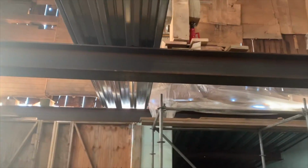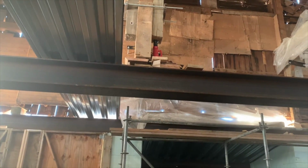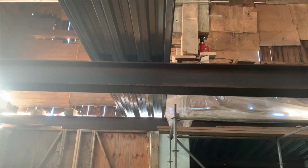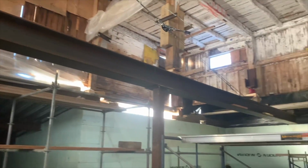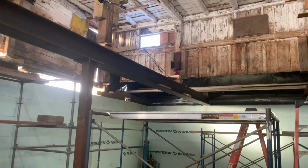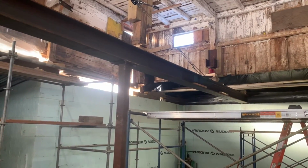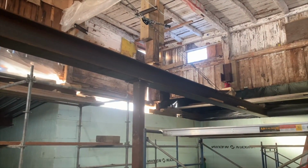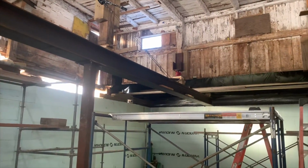Then we need a couple of days with a welder to put miniature steel posts under each wood post. Once those are in place, weld it to the beam, steel decking gets cut around them, steel decking gets welded down to the steel beam. Then we have a stud welder come in and weld studs to the top of those beams. Then we do our rebar grid. Then we do our 6x6 concrete wire, followed by thousands of feet of PEX tubing.